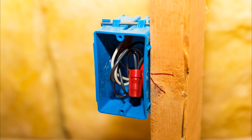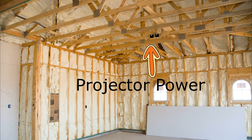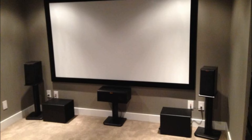The second power consideration is projector power. If you're doing a home theater room, this may sound like a mistake you wouldn't make, but we go into dedicated rooms all the time and they're missing power for the projection — it's crazy but it happens. The last one on power is making sure your subwoofers are covered. Run a 20-amp dedicated circuit to the front of the room for your AV gear, but also get circuits to the left and right where your subwoofers will go, so you don't have subwoofer power cords running across the room or extension cords.